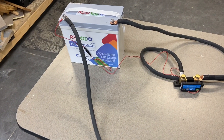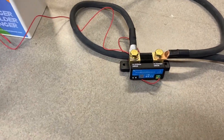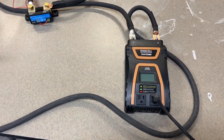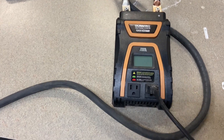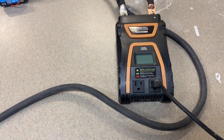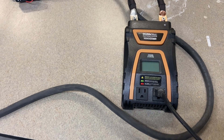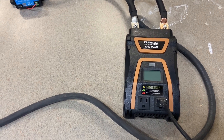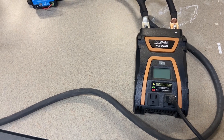Here is my highly sophisticated testing setup. I have a Victron SmartShunt 500 amp going through this extremely cheap Duracell 1000 watt inverter — wouldn't recommend these; I think it's a modified sine wave. It was at Costco for 30 bucks quite a while back. I'm going to try to get a 0.2C rate, which means if it's a 100 amp hour battery, it'll be 20 amps of discharge.